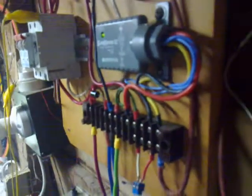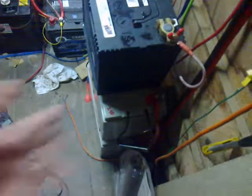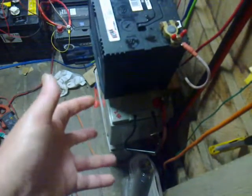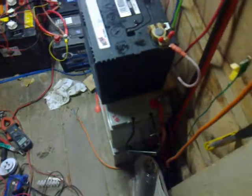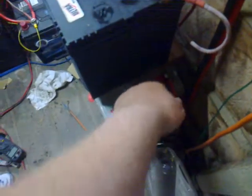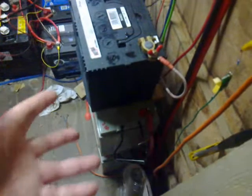But I brought this in, and it's basically a pilot battery, so it allows this charge controller to operate at a higher voltage while not pumping up these gels, which I've always had trouble with from the day I bought them, being really sensitive to overcharging. In fact, when you're not overcharging them, they act like they're being overcharged, frothing, pumping out a bit of liquid at the top. Well, that seems to have abated now, but I think these are on the way out.